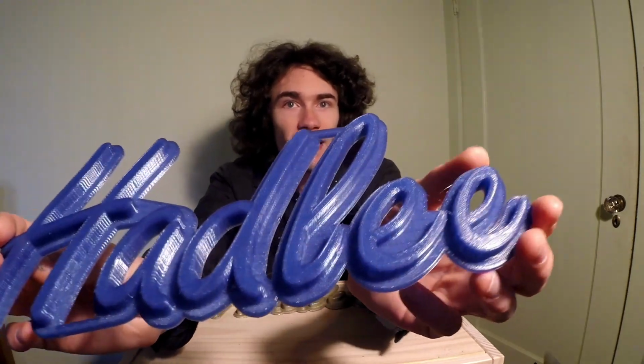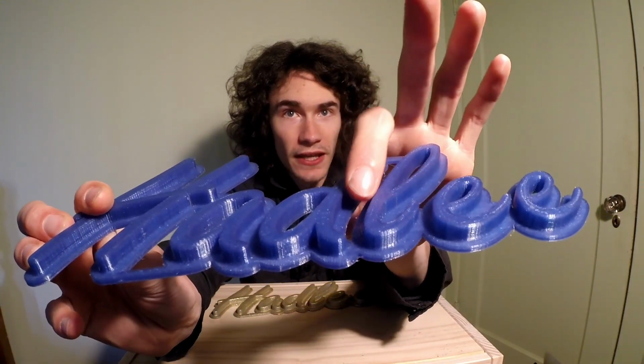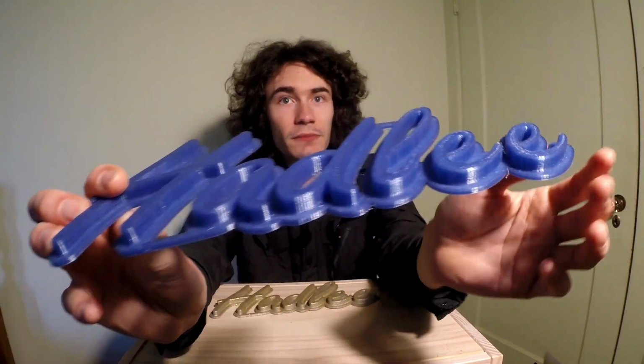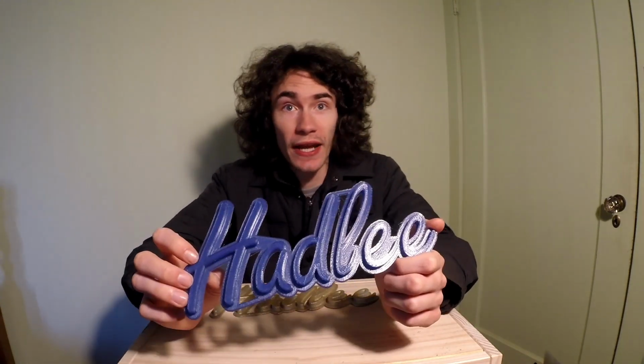So one other thing that I did that was purely cosmetic is I did decide to round over the edges here on the top and down there at the bottom. Like I said, purely cosmetic, but I figured even just a small 35 to 40 thousandths radius would at least look a little bit nicer than just a straight sharp corner, and I find that slightly rounded edges tend to print a little bit cleaner than sharp corners as well. You don't tend to get that curling on the edge sometimes, things like that. It was nice not to have that there.